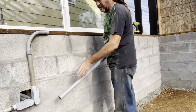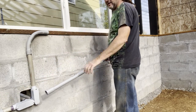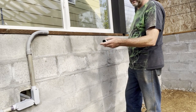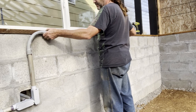I have everything down here all glued together, but from here on up I'm probably not going to glue them, in case I need to change something. If you glue them and then need to change something, you have to cut them, and that ends up costing you money.